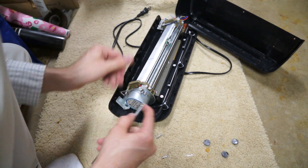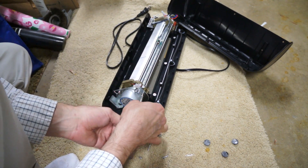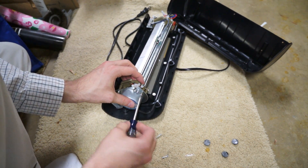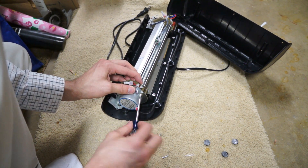Just for reference: the small gear goes on the motor and the big one goes on the roller. That's what gets you the mechanical advantage of making the roller go slower and presumably with more torque — but really all I'm after is slower.